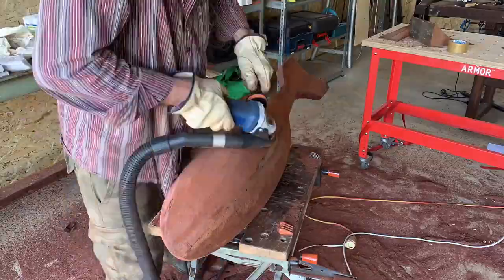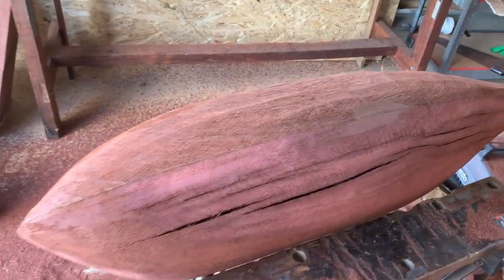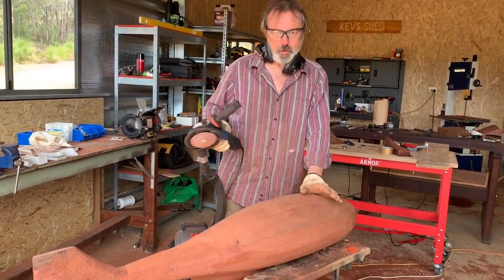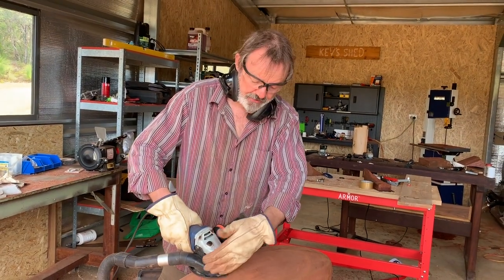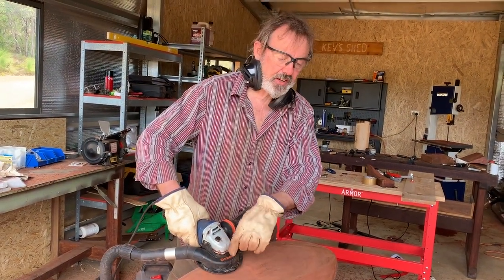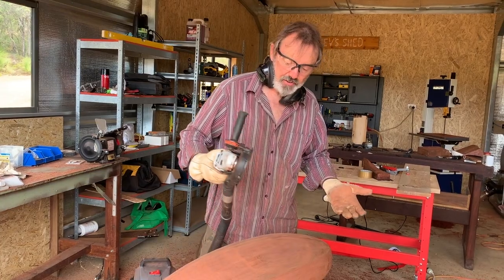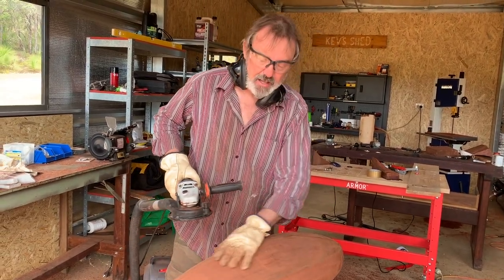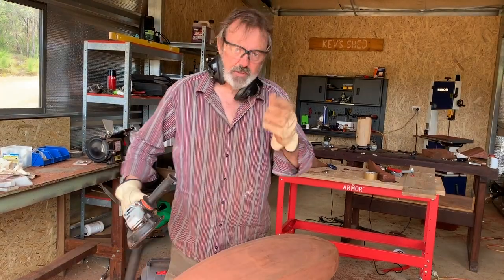It's starting to look distinctly sharkier, nice and thin, I'm pleased with where it's going. I've just got to blend some of these curves out a little bit more. The important thing about sanding worth mentioning is when you're moving the machine you don't go backwards and forwards and backwards and forwards - as soon as you stop you create an excess of sanding load. The idea is to keep the thing moving at all times. It's the same with the belt sander, orbital sander, random sander - the whole thing. As soon as you stop and change direction, you get that excess. So always keep your sander moving, a bit of a figure of eight, or at least in a line and then off and on again. Little tip of the day there.